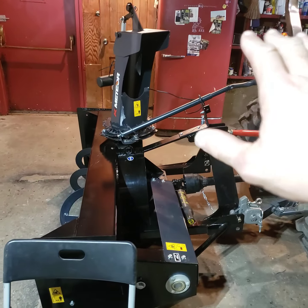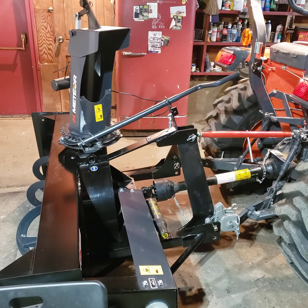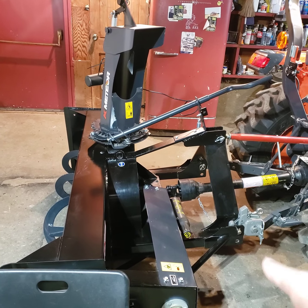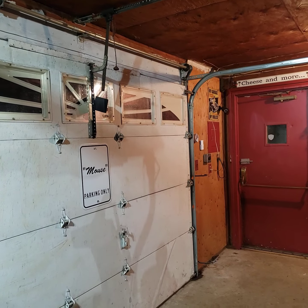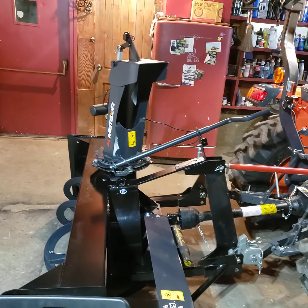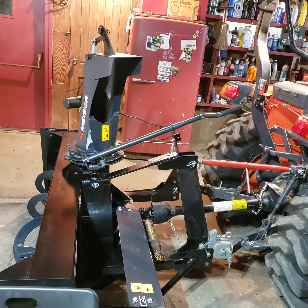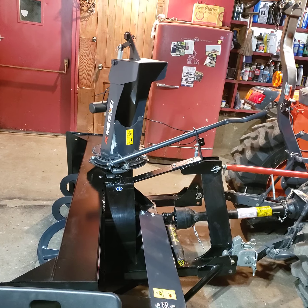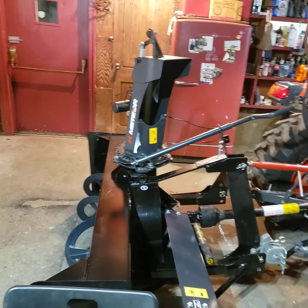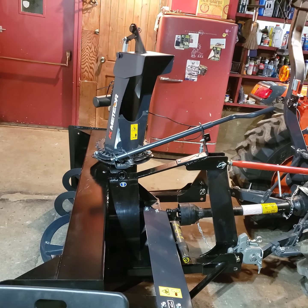So it's 51 inches top to bottom. MK Martin, 60-inch width or less comes standard with the crank handle, okay? Which I wanted, because I have a 7-foot door. I will never have a cab. It's Wisconsin. We don't get cold. So I wanted the manual. Well, 84-inch and above comes with the hydraulic setup with the hoses and all that. 60-inch and below, they come with the crank handle. The 68-inch and the 72-inch don't come with anything. They don't tell you this.